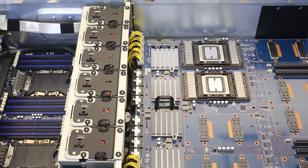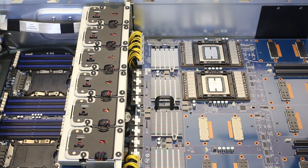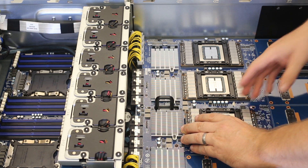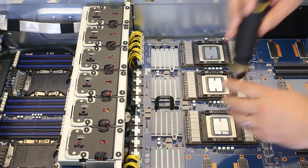The SXM2 GPUs are extremely difficult to install, so we made a little video on how we did this. SXM2 pins are extremely fragile, which means that we had to remove the protective covers from both the GPUs and the PCB that we're going to mount the GPUs on. Part of this process involves aligning the SXM2 GPU with the slots. It's actually keyed so it's not that hard to do, but we were told that most factory installations use a custom-made jig to align the GPUs properly.